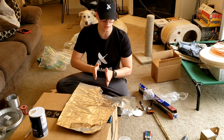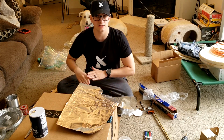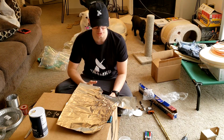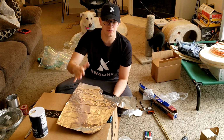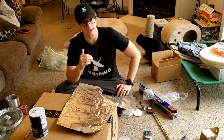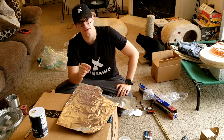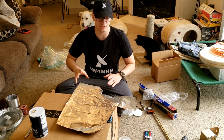So now what we're going to do is make our capacitors. I mentioned that we're using Leyden jar capacitors. These are pretty much homemade capacitors, usually made with glass bottles or plastic bottles, and some type of aluminum foil or salt water mix. We need exactly 8.6 nanofarads of capacitance in order to get this thing resonant.